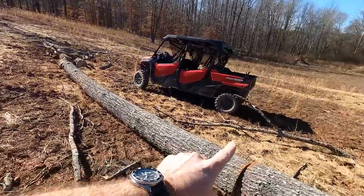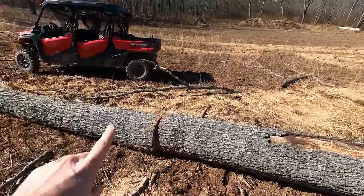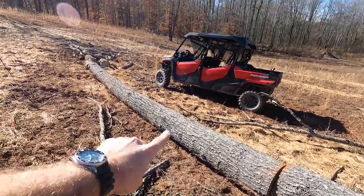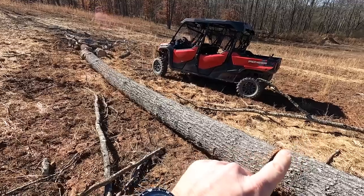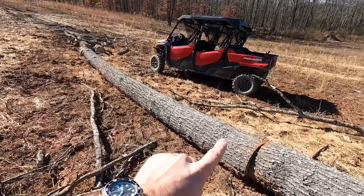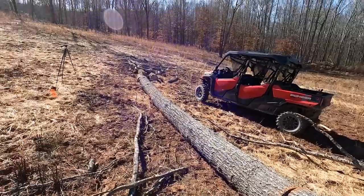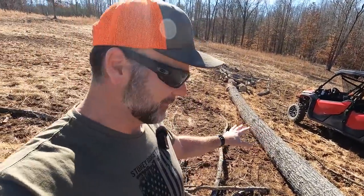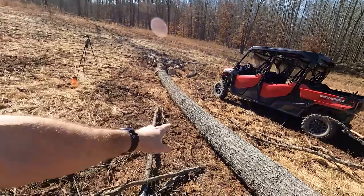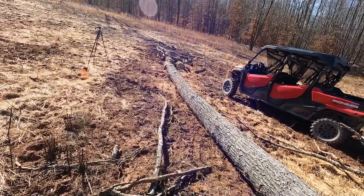These 8 footers will be used for fence boards or floorboards, 1x6s, and we're gonna try and mill out at least 6 true 4x4 or true 6x6 posts for the mezzanine to go into the mega shop. So this is milling with a purpose today for sure. Without further ado, we'll roll this log over, I gotta make that cut, and then we'll go get the skid loader and get busy.